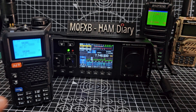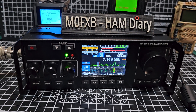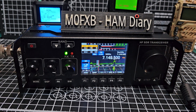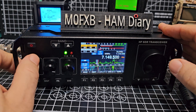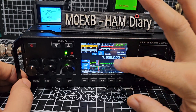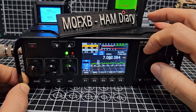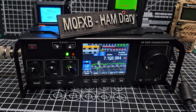The last one is a radio I only discovered this year: the RS918. There are two versions — I've got both coming for testing. This is the one that is better for firmware customization; the other version is the BS188, which comes with a pre-installed battery. There are many parameters you can set on this HF radio. It covers 1.8 to 28 megahertz and it is touchscreen — you can touch the frequency and it will take you there, though it's a lot easier with a stylus. Press the VFO button and you get bigger steps for changing the band. The touchscreen also lets you change the SWR meter settings. I've made many videos on this radio already.